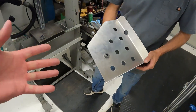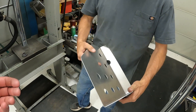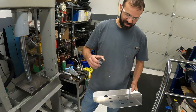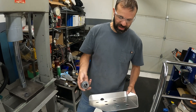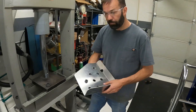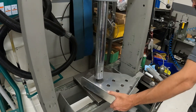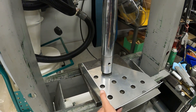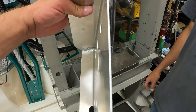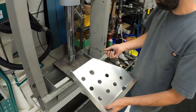What we're doing right now is the dimple dies. You can see this is just a flat piece of aluminum — it's strong, but it can be stronger. These dimple dies are really going to do that. We'll reverse them so we can dimple it back towards us for grip. It'll strengthen it too and give us grip — just like in our old Jimco. Here we go. You can really see how that's forming the metal — it makes it so much stronger. A flat piece of metal gets a lot stronger with these.